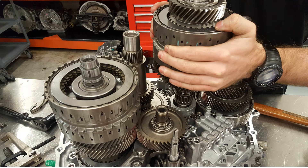After the clutch assembly we proceed by putting the input shaft, or main shaft, in. One thing to bear in mind is that the input shaft, when you put it inside, is going to stick out of the transmission case. If you're working on a bench, you will need to put something underneath the transmission case so that the input shaft can go its full length and sit really well in the case. If not, it's going to bottom out on the table and not sit well — that's why we need to put something underneath.